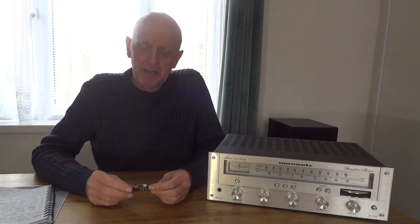That needs repairing — you don't want to leave it in that state too long because that arcing isn't doing the receiver any good. It's supposed to be a dead solid contact. Unfortunately these switches are not cheap. You might find one off the shelf, but don't buy a second-hand one from another old receiver — even if it's working perfectly now, in another two months it'll be exactly the same. These switches aren't cheap even second-hand. I got this one from Germany; with postage to the UK it worked out about £31 for a switch, which is quite expensive, but there's not much choice if you want to get it running properly again.